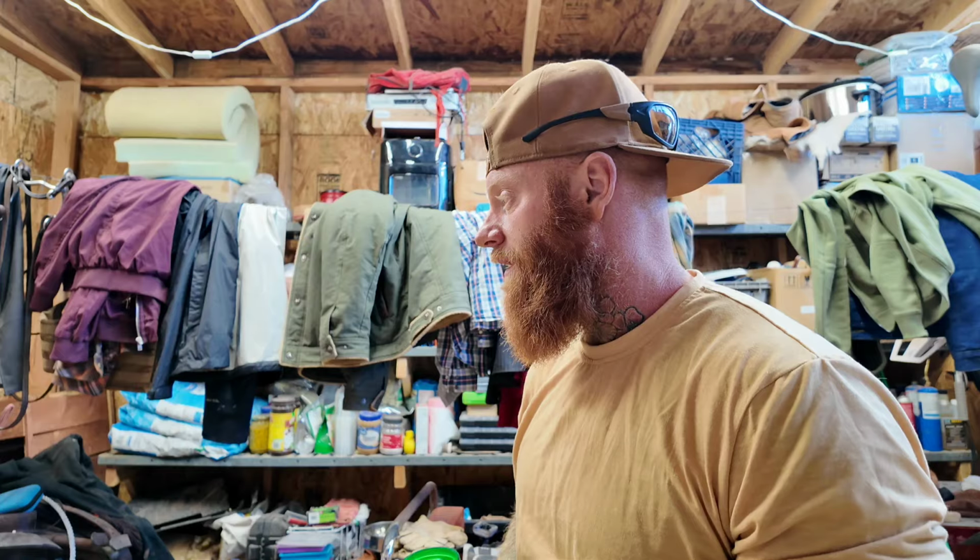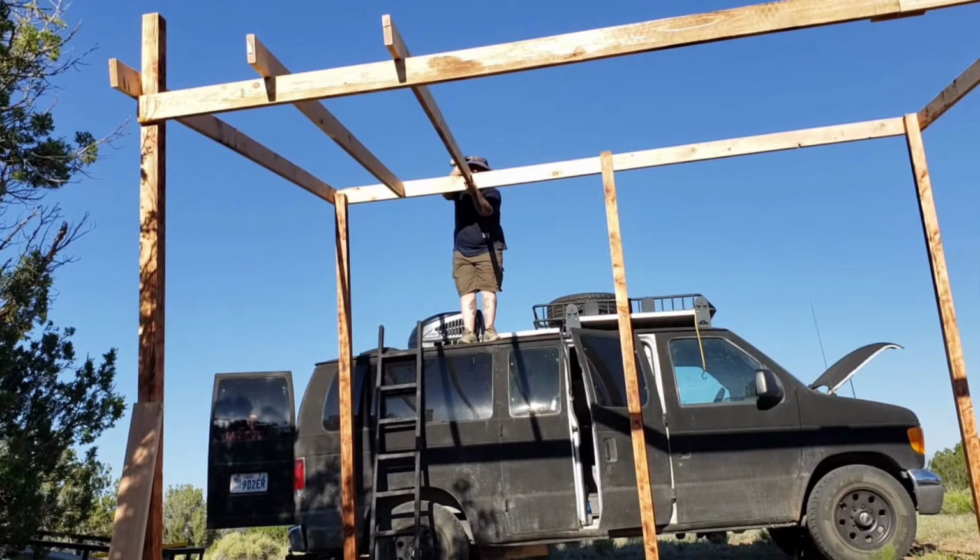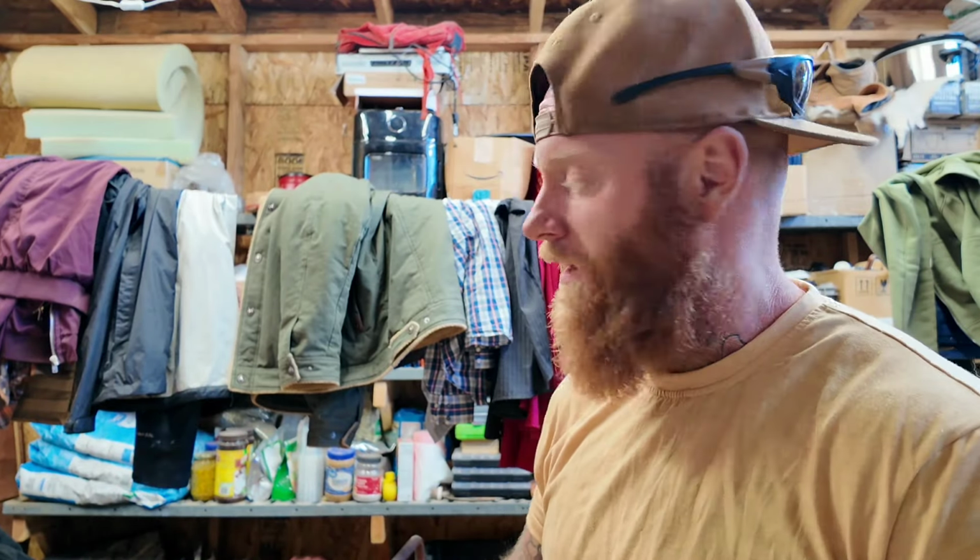And they will tell you often, hey, you should just go straight to a 48 volt system. I know they say that a lot, but I disagree in a lot of scenarios if you're trying to be cheap or frugal. And one of the arguments is if you get a 48 volt system, the copper wiring is cheaper. But I'm telling you, starting out here off grid, I had no money or nothing. And being able to just grab a 12 volt charge controller, a 12 volt inverter, a little bit of wire here and there, that's the most expensive part. And it's not even that bad anymore.